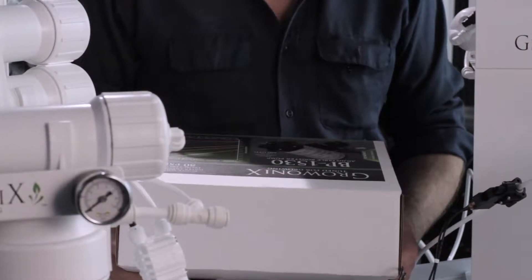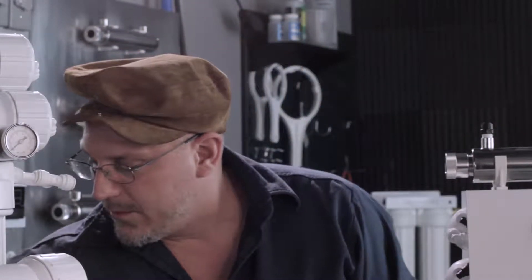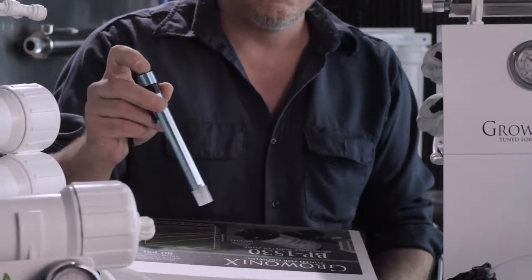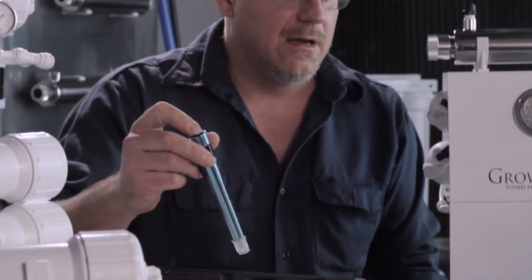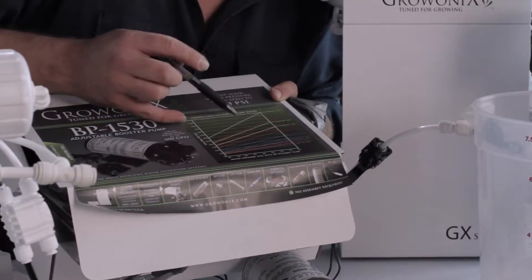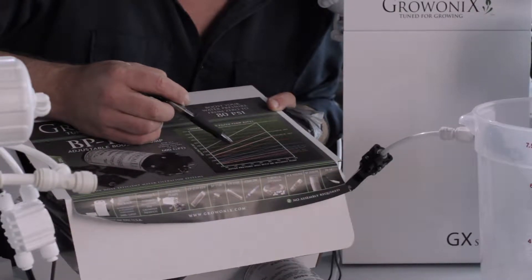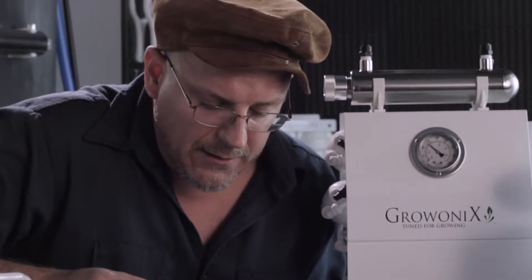My water here is about 78 to 80 degrees today — I checked it with one of these handy Myron TDS pens, which checks temperature as well as parts-per-million TDS. Following the GX400 line at 77 degrees and going up from 54 psi, I should be flowing about 330 gallons a day. Measuring the output of this unit, it'll be about 330 to 340 gallons per day.